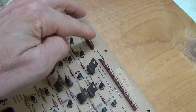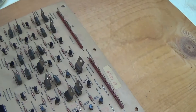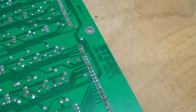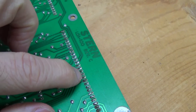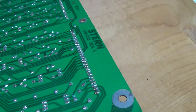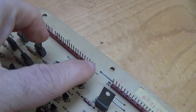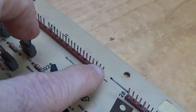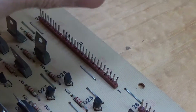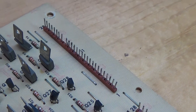So always focus on these connectors and really think deeply. In this case I was kind of focused on the back of the board looking at the traces and where they're connected. Because a lot of times these solder joints here degrade, and that's usually where the issue is. But quite often you also get degradation of the pins themselves, as you see here. And they're just not contacting the other side — the female end of the pin.